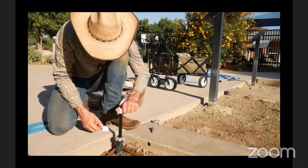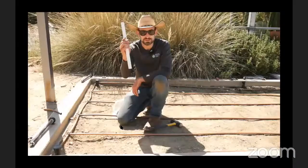And so what happens is, when your sprinkler system turns on, or your drip system turns on, because it's capped, when this pressurizes, it just pops this up, and it's an indicator that the system is on. And that's useful because if for some reason something's wrong with your timer and it's running when it's not supposed to be, or gets stuck on, or your valve gets stuck, with a drip system, you might not notice for a long time. And so with this indicator that this is continuously running, you'll notice it and you'll know to check.